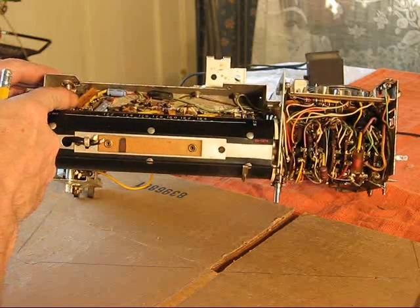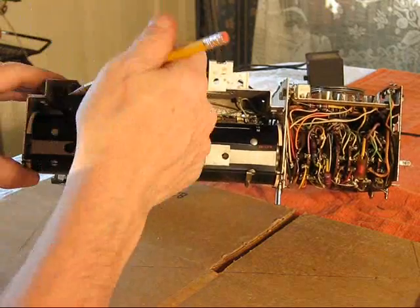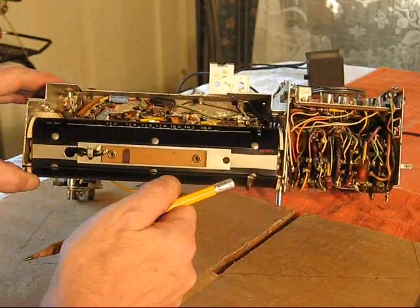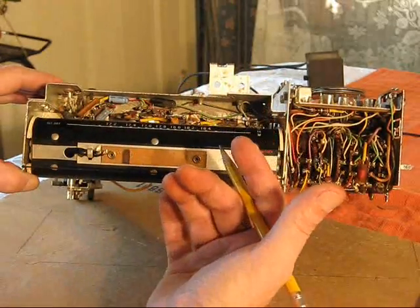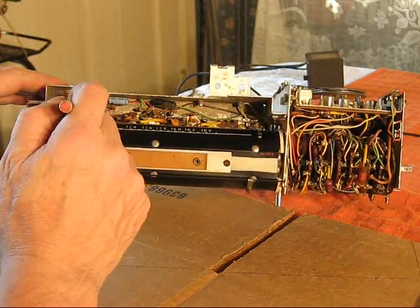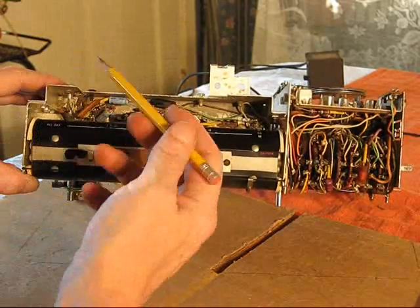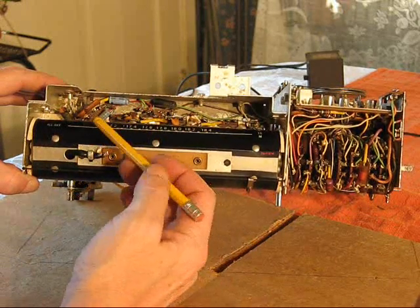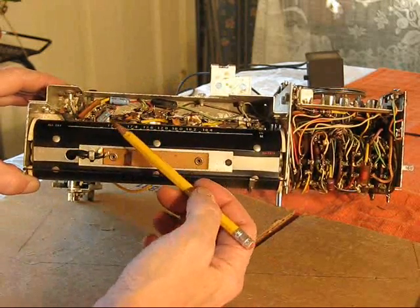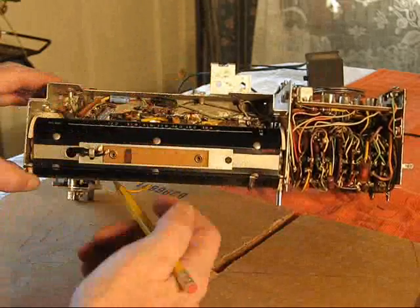It's a 3-lead. It looks like a rectangular shaped ceramic capacitor, which it kind of is, but it's also got resistors in it. 2 resistors, 2 capacitors in that. It's a network. I think they did it that way because those components need to be fairly well matched, and with temperature changes and so forth, those 4 components, 2 resistors, 2 capacitors, being all in the same package would facilitate that. Not to mention, with the common coils they used back in those days, the RC network there was always the same. So it kind of made sense to make that one package rather than having to string out 2 resistors and 2 capacitors for that network.